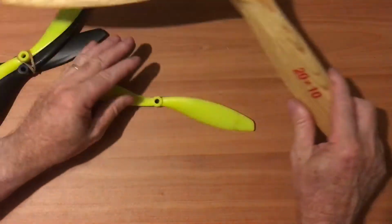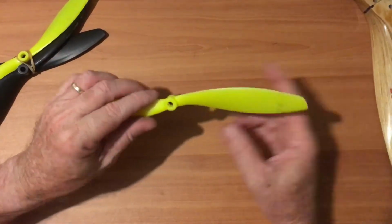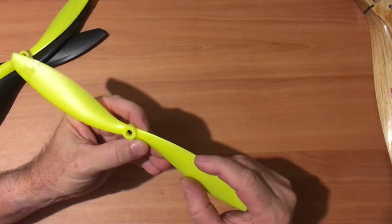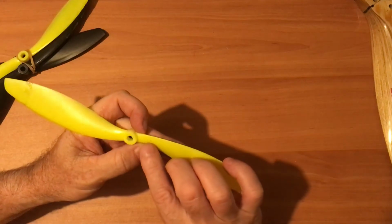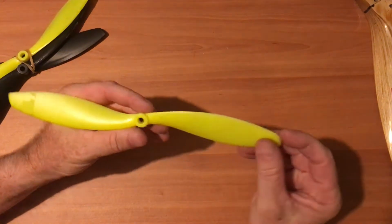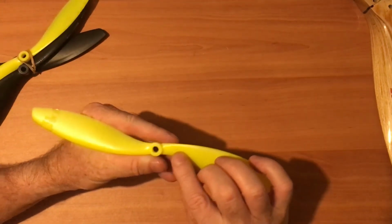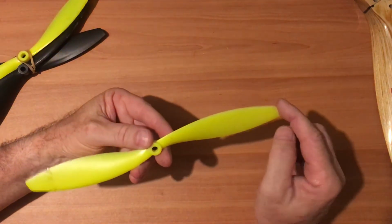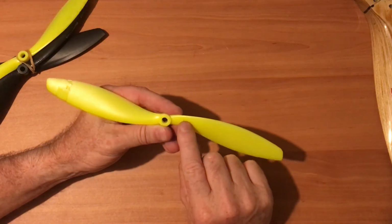Okay, so that's a big aeroplane motor, a model aeroplane with a large 50 cc motor in it, and these are drone propellers. That's metric there, and it's also got imperial here. So it's got 10 inches by 4.5, so 10 inches long by 4.5 inches pitch. So 10 inches is diameter, and the 4.5 inches is every one revolution it would go 4.5 inches forward. That second number is really quite important.